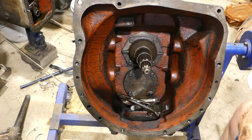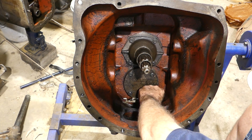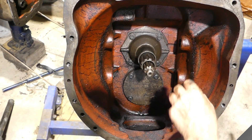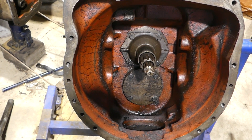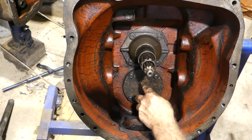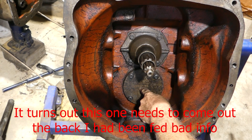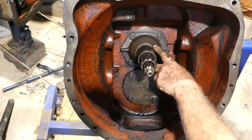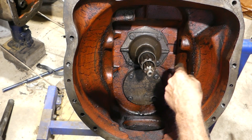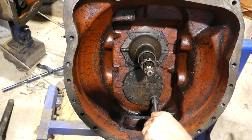And what we're left with now is the start of actually getting the front seal and the front bearing carrier and all that done. So this next part we're pulling off on the front of the transmission here. On this tractor I believe this job - this top seal - can be done without having to split the tractor at the back of the gearbox. So even though we have that done, just for convenience for filming I'm going to try and get this front housing off to replace the seal and the bearing without removing the back shaft.